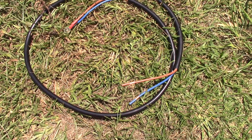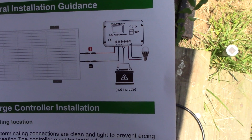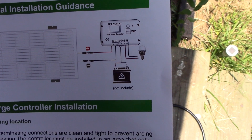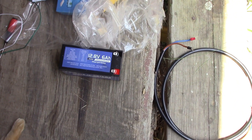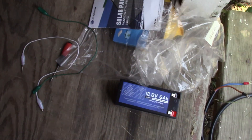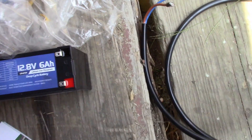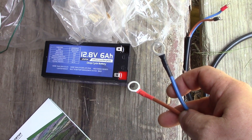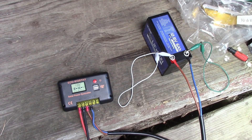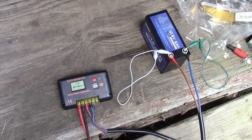This wire here is for your battery. These have already been cut but they don't have the connector things on the end yet. In the manual it shows that these leads can either go to the load - an inverter as well - or a battery. As you can see, this 12.8 volt 6 amp-hour battery hasn't got the correct terminals on it. So just for testing purposes - and I won't do this at home, as they say - I'll secure them with these clip leads to get a decent connection onto the battery. So here we are connected up: panel on the left, battery in the middle, and a 12 volt load or inverter can be connected to the right hand side.